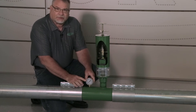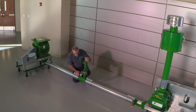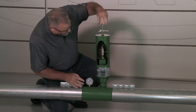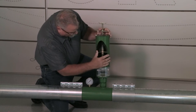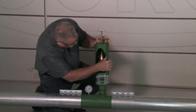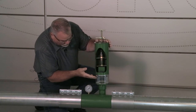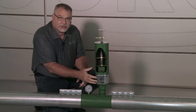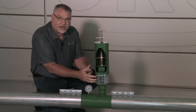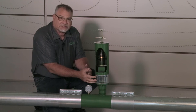If we have less than three pounds of pressure, then we have to start looking at what we need to do to adjust the velocity compensating valve. Typically the first thing we're going to do is back the top stem valve off to reduce the pressure on the spring, and turn the long nut up so that the restrictor cone closes all the way down. You're probably going to need to turn both at the same time in order to keep the pressure off the spring and keep this turning to the point where that restrictor cone will come closed. Keep in mind that this is being done while the system is running with grain coming through it, at a minimal amount of grain capacity — on a Sukup automatic grain dryer that's going to be about 10 percent meter roll speed.